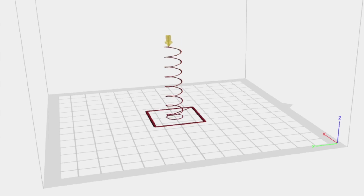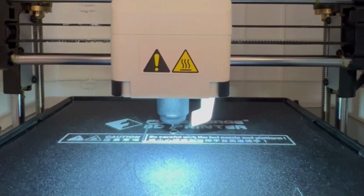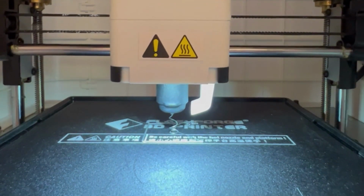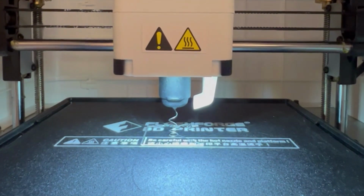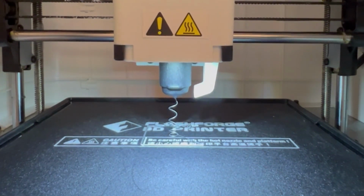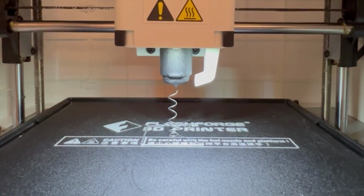These physical properties are particularly important for compliant mechanisms in which the structure of the print itself dictates the degrees of freedom through the similar intentional under-extrusion or over-extrusion of the filament. This further opens up new design possibilities that otherwise are inaccessible with 3D printing.